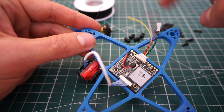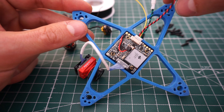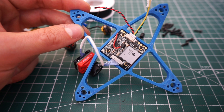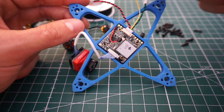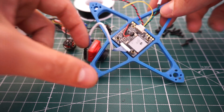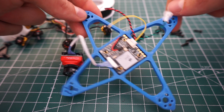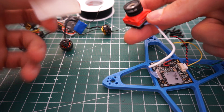I won't do the wiring here just to keep the video from running too long, but basically the Caddx board wiring: the power line goes directly to the 2S battery since the board takes 2S. The video signal line goes to your flight controller where you'd normally plug in the camera video signal. The camera is plugged here to the board and this little connector is for the joystick plate to control the camera and adjust all your settings.